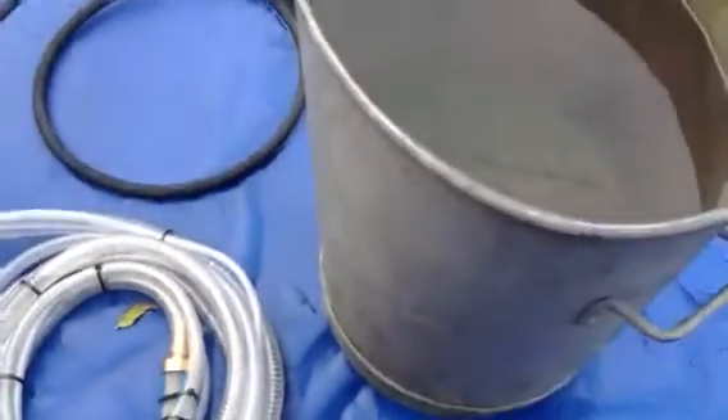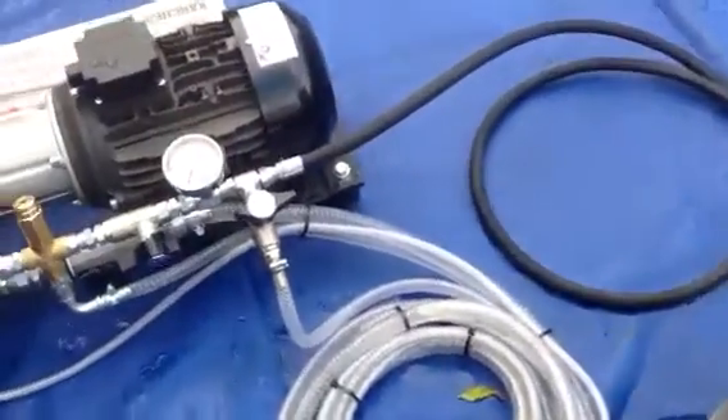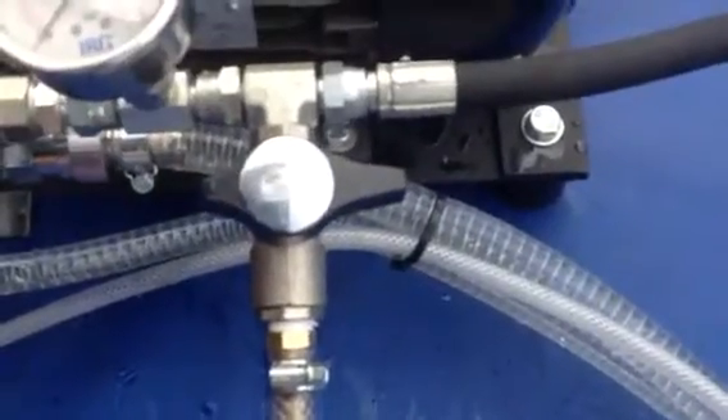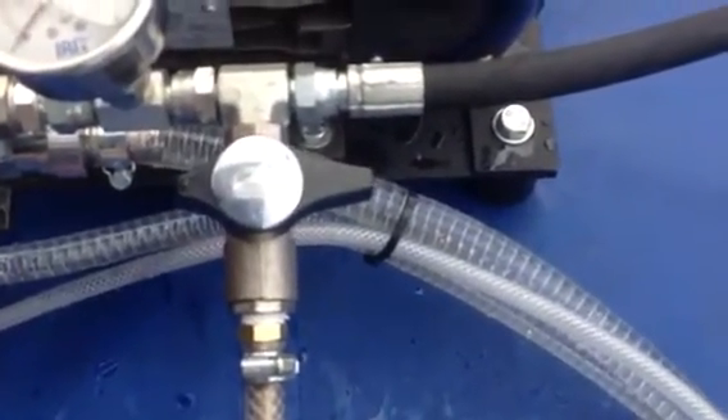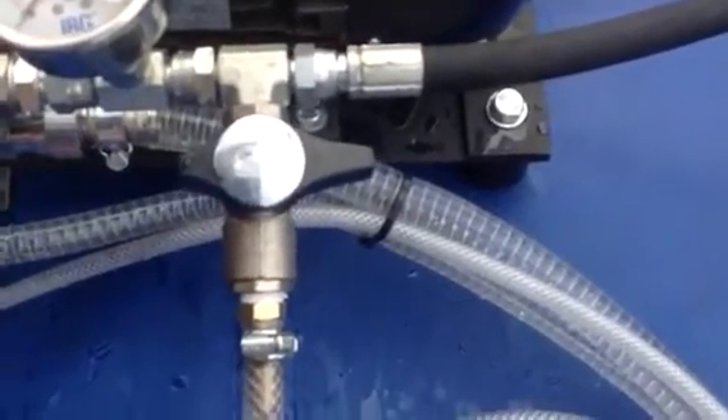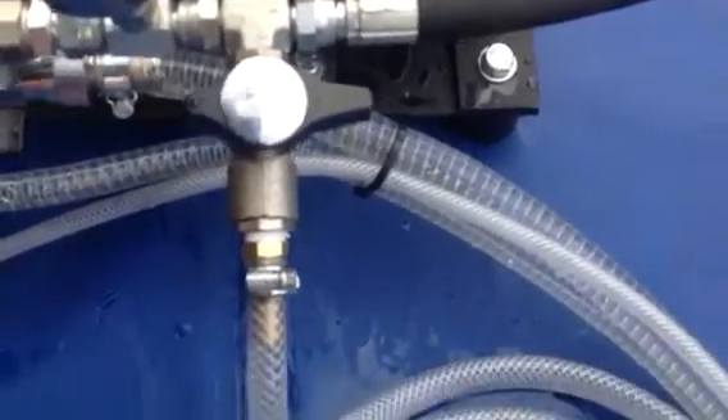What we've simply done is set up a tub of water here so that water is recycled. Your high pressure line goes to the vessel you're testing. There's a prime valve here to open up so you can quickly prime the system and also disconnect the system itself when you've tested it — open it and the water will return back to the water tank.